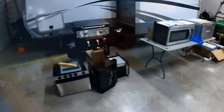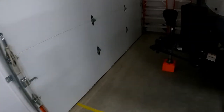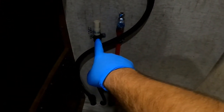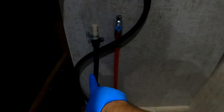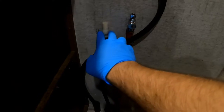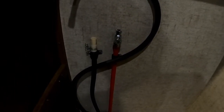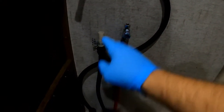Okay. Back in the shop today. I have been, as I was mentioning earlier, working on the plumbing for the dishwasher. And I turn a light on here. I have got the drain line, which is this line here, which is actually a Fisher Paykel drain line. It kind of looks almost like split loom tubing, but that's the drain line that they actually use with those dishwashers, with another little fitting here that just clamps together. Not a big fan of that, but that's how they make them and how they want the connections to be made. It's readily accessible by pulling the cooktop out, so I decided I'd go ahead and use that.